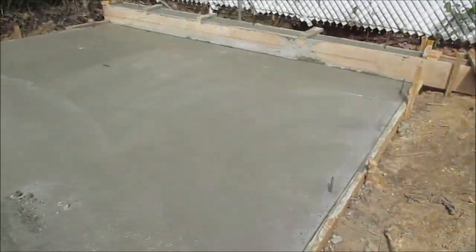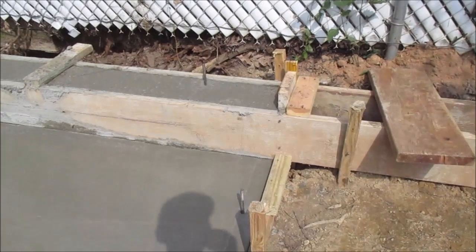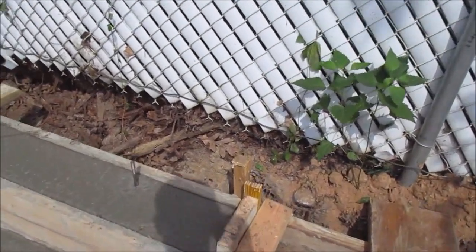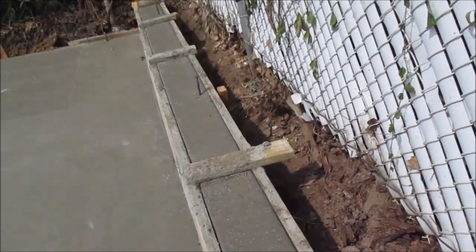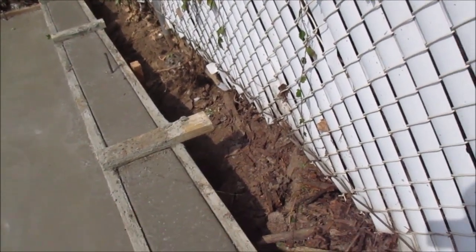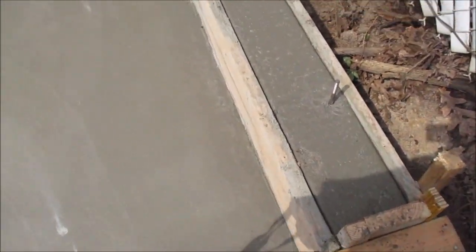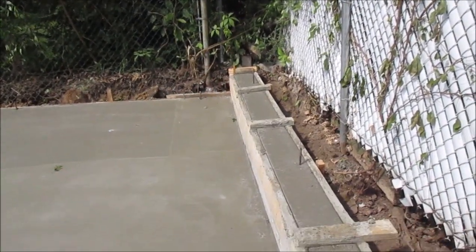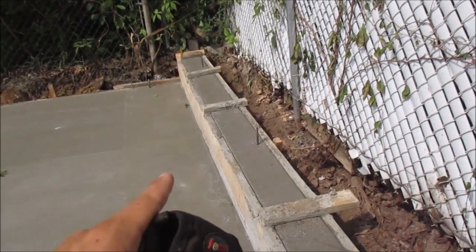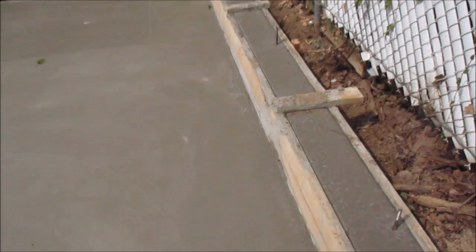What we had to do over here was cut your anchor bolts in so they could frame on top. And we had to set this wall over here. And what this wall is going to do is hold back the neighbor's dirt here. Once they backfill this with some dirt, they might run a block or two here and here. The only thing was we couldn't really run a return for this wall because the floor has to be finished nice. This floor is a finished product.